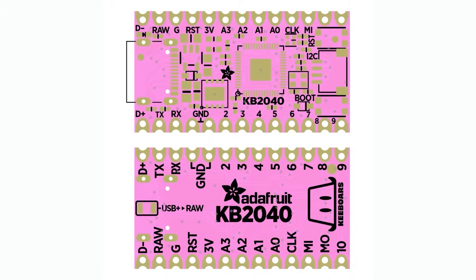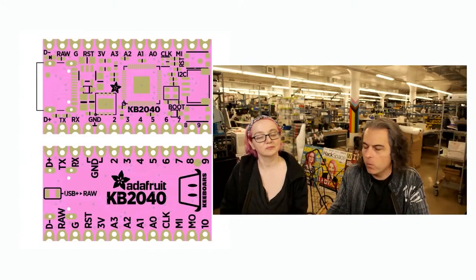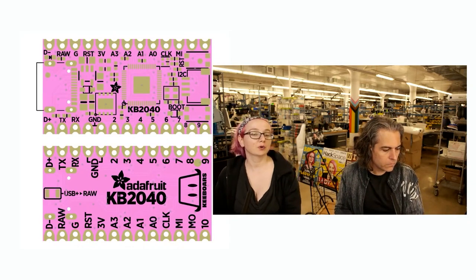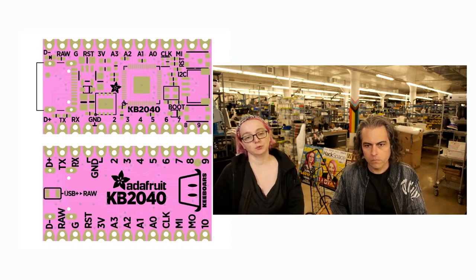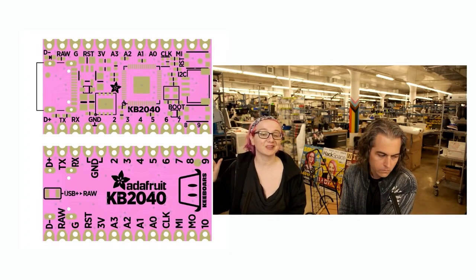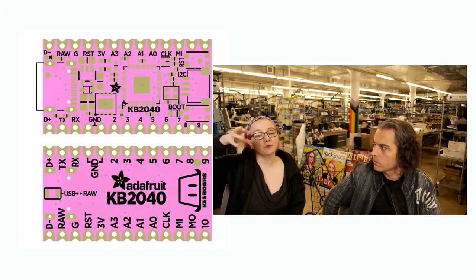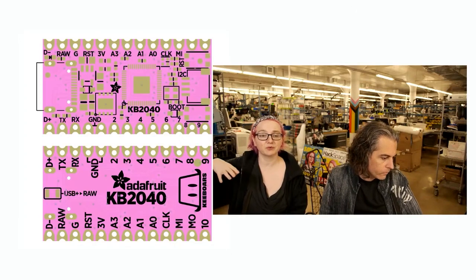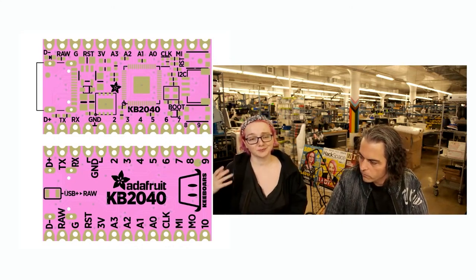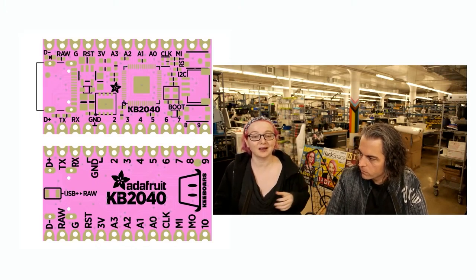This is the board. It's a keyboard, and we want to make the best keyboard Pro Micro board. We did a lot of work with the Macro Pad on getting really good HID keyboard matrix scanning and keyboard interrupt support into CircuitPython. People really like making keyboards with the RP2040 and the Pico. We wanted a board that people could use with existing designs — a lot of existing keyboard projects use a Pro Micro, which is a 32U4-based pinout. So we looked at the 32U4, the Elite-C, the Pro Micro, and SparkFun's RP2040 board, and asked: what would be a really good CircuitPython development board for people who want to do CircuitPython HID keyboards? Right now there isn't QMK support for the RP2040 — there's an open issue, but I don't know when it's going to happen.